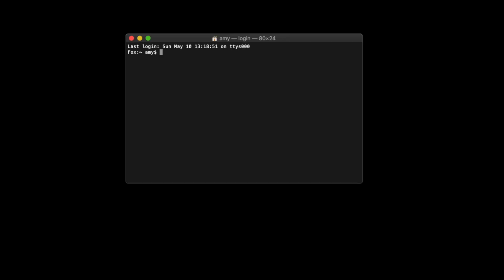Now for Wireshark. This is a packet sniffing program. People often use it to analyse network traffic, but it'll do USB too. There's one thing we need to do before we can run it on our Mac. Enter this command into the terminal. This brings the interface for monitoring USB traffic online.